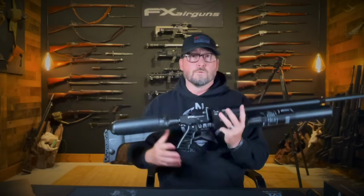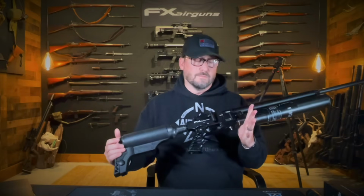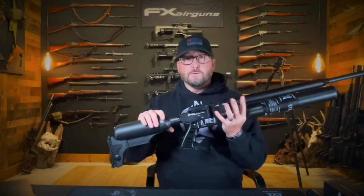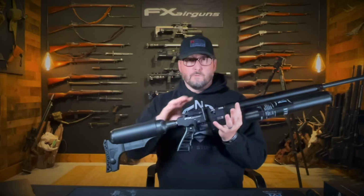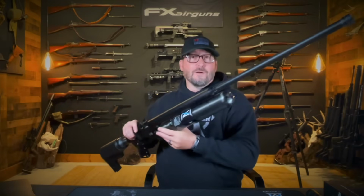And so to run this test, I'm going to be doing this at a relatively low air pressure when it comes to big bore air guns. I'm going to be doing it at 170 bar as compared to other big bore air guns that I have on my rack. Some of them are 200 bar, which is 3,000 PSI, all the way up to 250 and even 300 bar, which is 4,500 PSI in some of those bigger ones. So we're going to be doing this at a lot lower pressure, but we're going to be relying on the efficiency of the valve and the barrel length. So look at this thing.